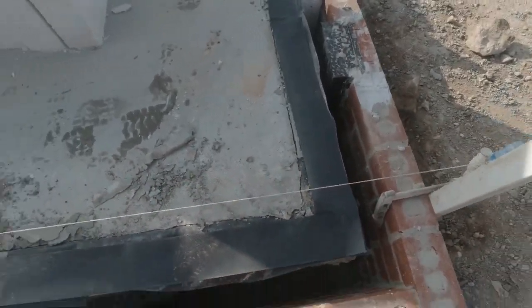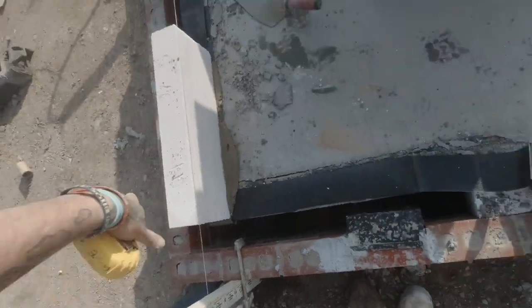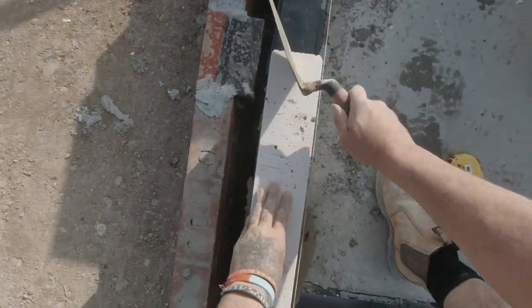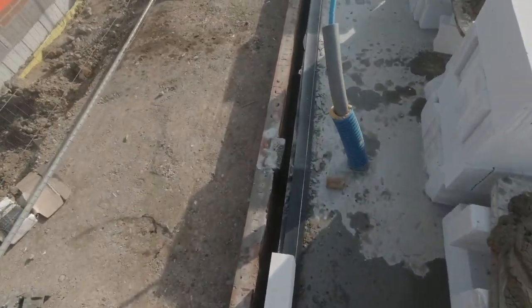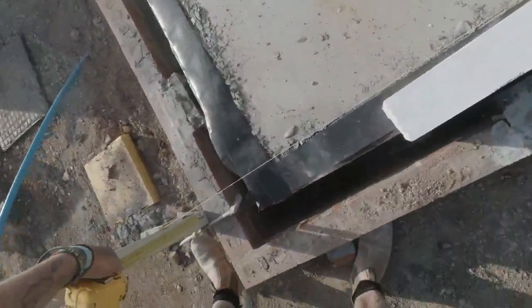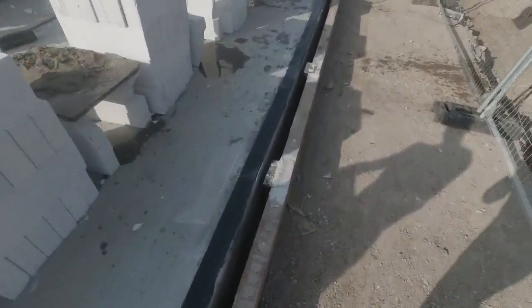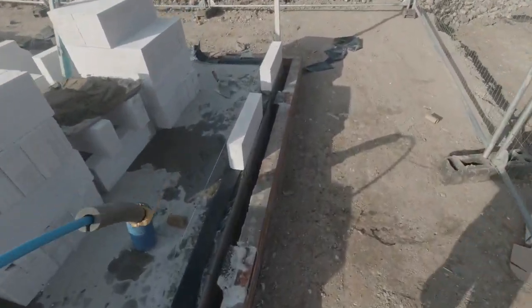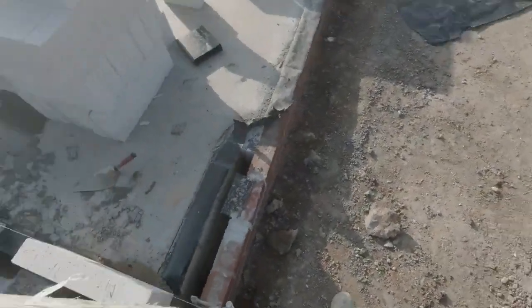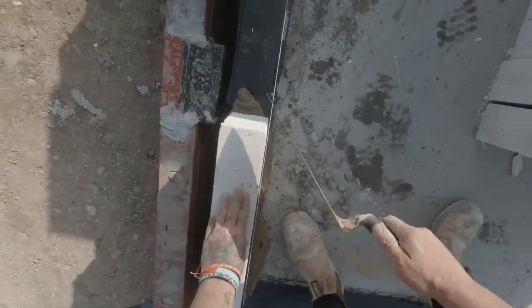Okay. That's us there. Let's get this to 225. 225 there. Doesn't look too shabby, does it? For height, let's just check the other end. I haven't engaged that other end yet. I've got the communal tape in my hand. Let's get you to the right gauge, 225 off of the footing. Then we grind down the blocks to get to our brickwork, and our brickwork stays nice. Sometimes you give it a couple of mil there, but we don't need to. We are good.